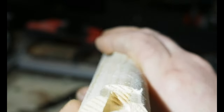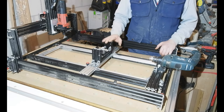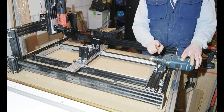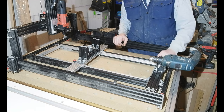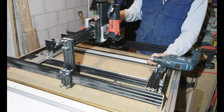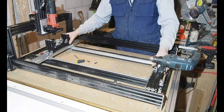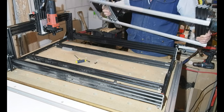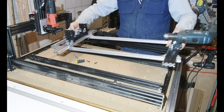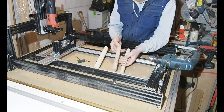That's a fair bit of potential having a rotational axis for the machine I think. The tailstock end I'm really happy with - it's solid, moves easily, locks well, and the mini tailstock itself works an absolute treat for its size. The headstock or drill end, not so much. The Wolfcraft drill holder really isn't solid enough for this use - I'll have to get another mount from Ooznest like that on my Z axis. I was just being a bit cheap. The drill's also not ideal - I may see if I can find an old Bosch or something of that type, as they not only have a trigger lock but also a speed dial, so I can do away with the faff of the clamp. Despite that, I couldn't be happier with the trial runs. It's a nice little addition to an already versatile machine and one that I can attach and remove as a whole assembly with very little setup required. I'm sure you'll see it busy in other videos this year. I'll make sure videos on the machine pop up at the end if you're interested in seeing its other uses, and I'll put links below to the Wolfcraft drill holder and mini tailstock in the description. As always, thoughts, comments and questions welcome below, and thanks for watching.